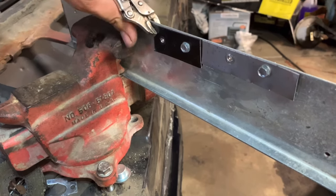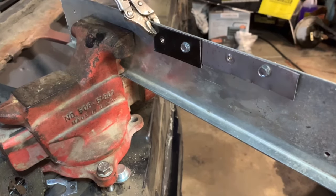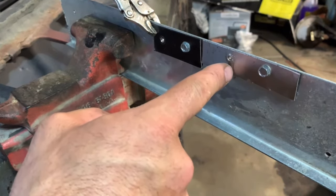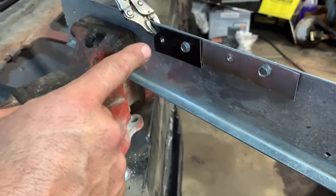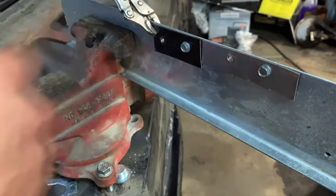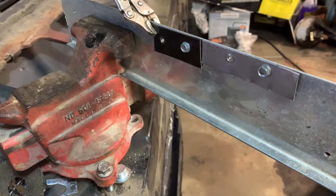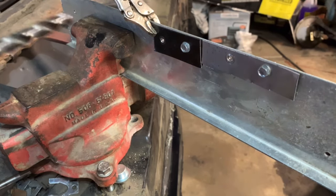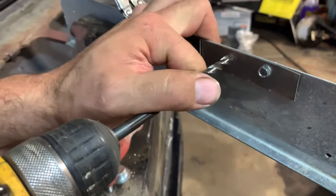Now we'll come back through and drill these out. The goal is to drill through all the layers — in this case I'm only going to drill through the first layer and just hit the base metal. This one I'm going to drill through one, two, and then just hit the base metal. You don't dig too deep — you just get through the top layers and just start to groove the base one, whichever way you're drilling. So we'll go ahead and do this one here first.